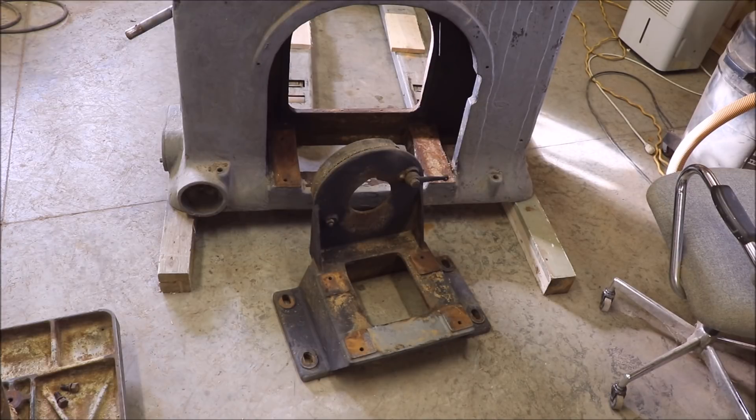On the other side of that is the brake system, which is basically like a rotary drum brake system. It's got a handle on the other side, and when you turn the handle, it expands the brake pads up into the inside of the bottom wheel, which is the drive wheel, and that will slow the bandsaw down. Otherwise, when you shut this saw off, it will keep turning for 15-20 minutes because of the inertia with the heavy wheels. It acts like a gigantic flywheel.